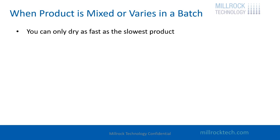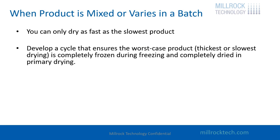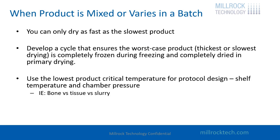Some people put mixed batches in their freeze dryer. Be aware that you can only dry as fast as the slowest product. Whatever the thickest, whatever the biggest, whatever requires the longest drying process — everything needs to dry at that rate. You have to always develop your cycles for the worst case conditions, not the best case, using the lowest product critical temperatures. A lot of times there'll be bone, tissue, slurry, collagen, or other materials in a system.